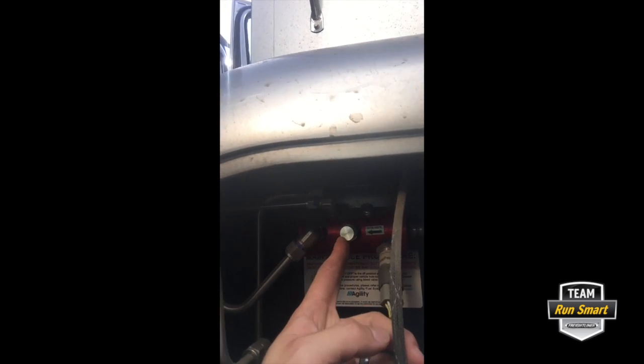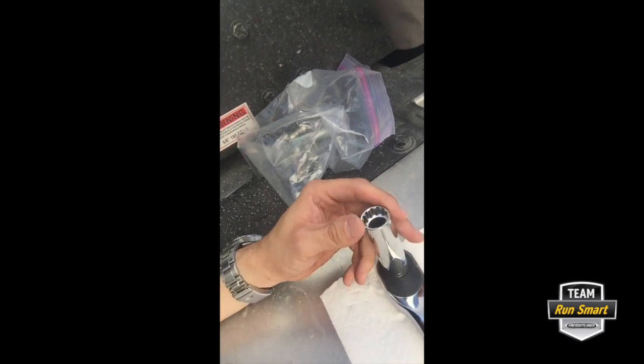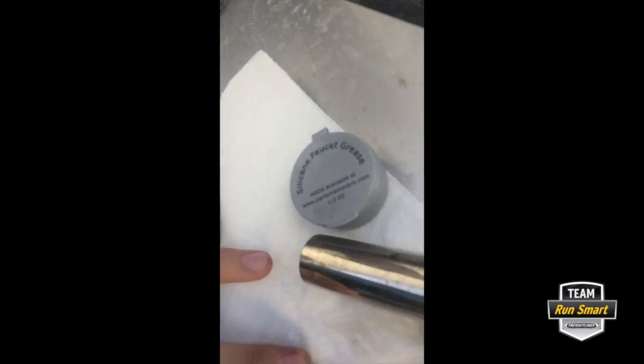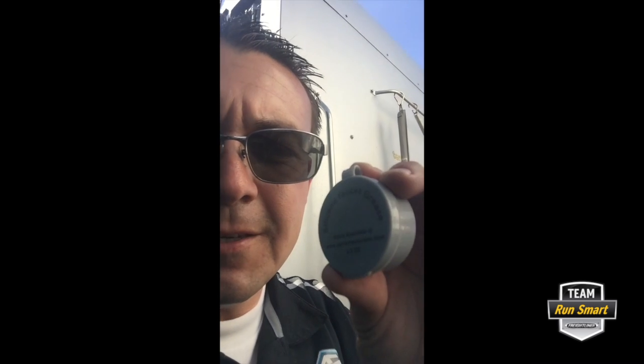While we're waiting for that to finish up, I'll bring you over and show you where the bleed valve is. This bleed valve will open up with a five-sixteenths wrench. We'll also have an eleven-sixteenths wrench or socket handy — that will be for actually draining the drain plug. You'll notice we also have our set of o-rings, and here's the handy trick: you have to properly lubricate the o-rings, so we use silicone grease — a silicone-base clear grease.